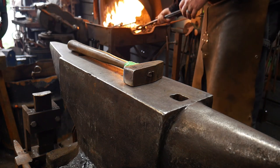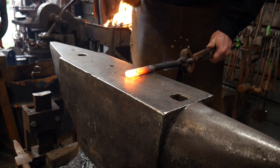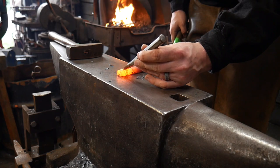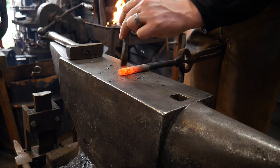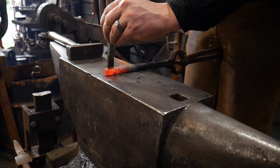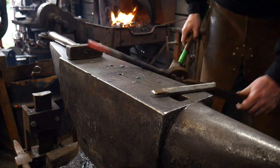Now that we've gotten the ball taken care of, we're going to come over to the anvil and put a little flat on it. What this flat is going to enable us to do is punch through this piece — slot punch this piece. We want to leave about the same material thickness on all sides around this piece and go ahead and slot punch it. Be careful — you can end up hurting your hand if you're not careful. Take your time, don't get in a rush. Haste makes waste, and the worst kind of waste is when it's your hand or extremities.